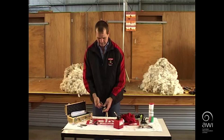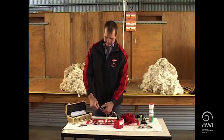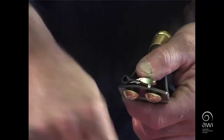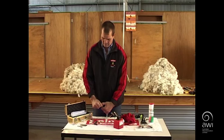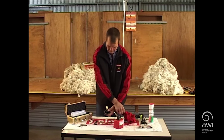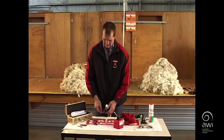Once a week, take out the chicken feet by turning them 90 degrees to the fork and pull them out. After giving the chicken feet and the fork a good clean, put new grease on the fork where the chicken feet fit and push the chicken feet back into place.